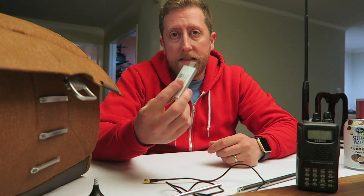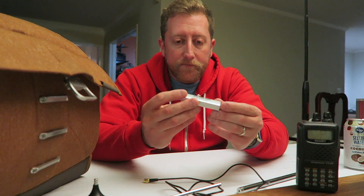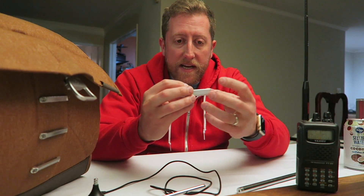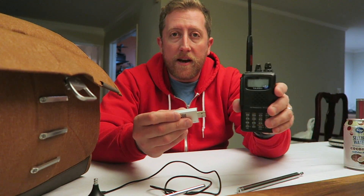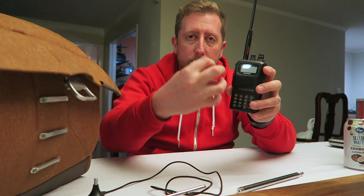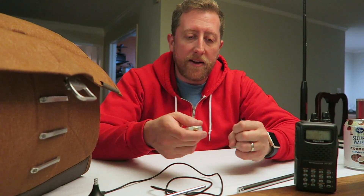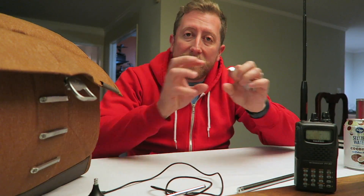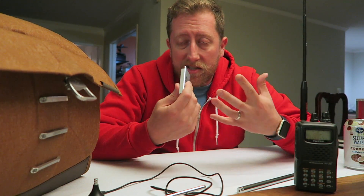You actually need a pretty decently powerful computer if you're going to be streaming the data — and that's what this is. What is radio but streaming data? The computer software performs the heavy lifting of what the radio does with internal circuitry. These are all separate physical components that do the work of the radio, replaced by a software title. It lets the CPU — the central processing unit — do the heavy lifting as one central processor instead of disparate circuitry. That's software-defined radio in a nutshell.